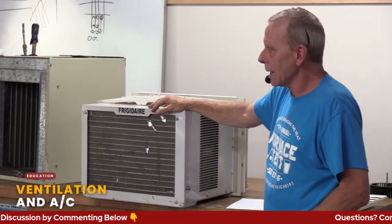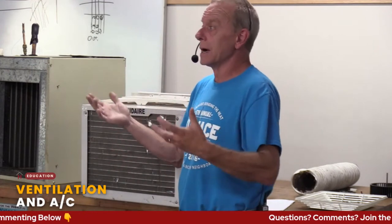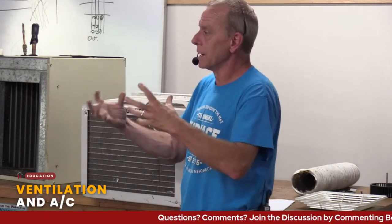The reason is that a lot of times, old school HVAC people will just throw in a large unit. They'll go, oh, your house is this big, you need a giant unit, right? And if the unit is too large for the space that it's conditioning, it drops the temperature down real fast, but it doesn't pull that humidity out. That's the second part of air conditioning that makes it feel comfortable. Have you ever walked into a house and sure, it feels cool, but it's a clammy sort of feeling? That's an indication that the air conditioning unit is too big, and it's just dropping the temperature without pulling that moisture out of the air.